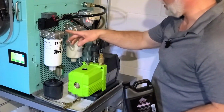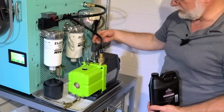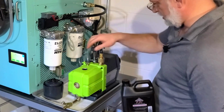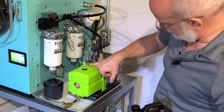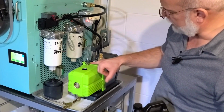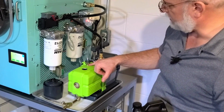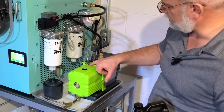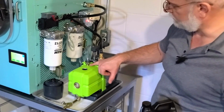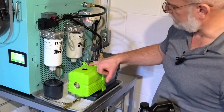So everything is done. All my hoses are on, my hose fittings. I don't have this pump on yet, just this one. It is hooked up to electrical. So when I turn it on, this is back into here. This fitting, the brass fitting that goes into here, I had to drill a hole into here and then tap this hole. A little bit of Teflon tape on there. And then I actually used some glue to glue the washer down. Kind of helped to hold it in there a little bit better. So that was Goop. So use that on there.